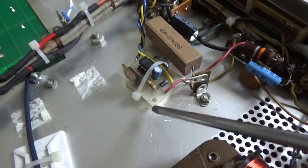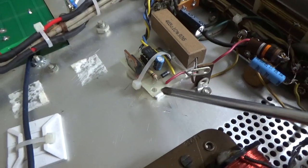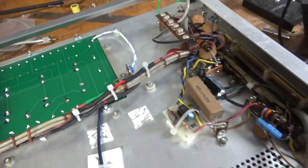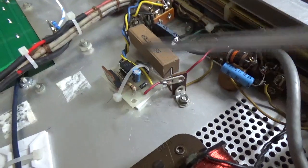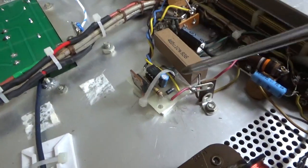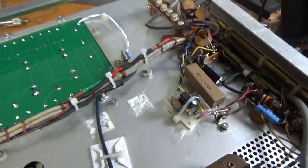Secured the soft key really well. I put a wire hole down and I also put some silicone between it and the board, and a zip tie. That's the double-sided sticky stuff on the hold-down tab. Normally it comes with a standoff but I've seen where those loosen up and bad stuff can happen, so even if it had that I would still add some silicone as a backup. So that was already in here and someone went in here and did some other stuff I had to clean up.